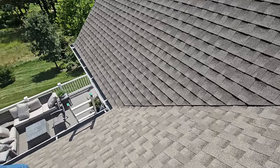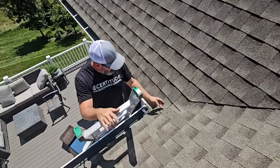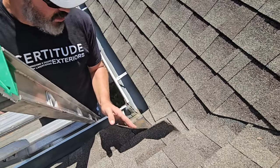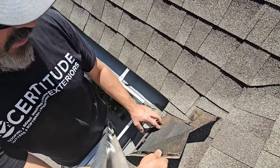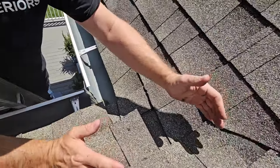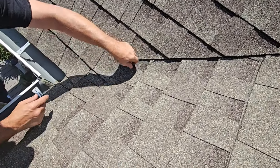Here's a problem with this roof down here — the roofers decided to put this seam right here, which is a no-go. You don't do that this close to a valley area. They also used an upside-down shingle as their starter, when you want to use a pre-manufactured starter to get the right wind warranties. This part needs a tar strip. You have to keep at least 12 to 13 inches out of the valley with a seam — they're right next to it. Then they just didn't know what to do here, so they put this short piece and let all the water run in through here.